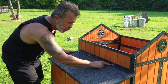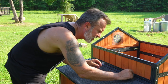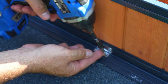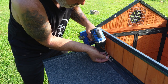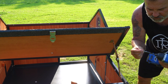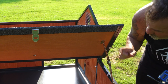Now we're going to get the nesting box cover - it's an asphalt top. Slide it up under; it's got holes for the hinges. Slide the hinges down over the pre-drilled holes - they should line up. Get your number 28 self-tapping screws, the ones with the rounded heads, set them right on top of the holes, and use a screwdriver to drive them in. Then attach the hinge supports to the bottom side of the nesting box lid using part number 29 - the larger flat-head tapping screws. You've already got marks showing where this should go, so just line it up to the center of the box and screw that in. Do the same thing on the other side.